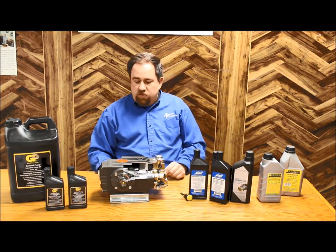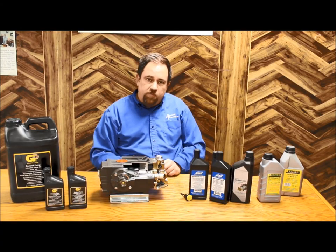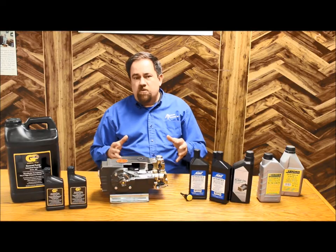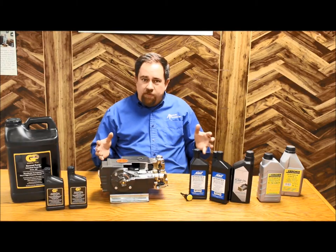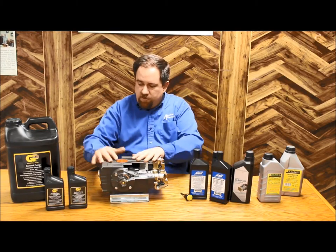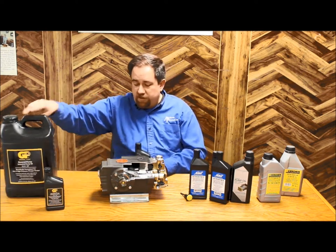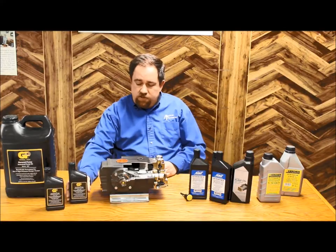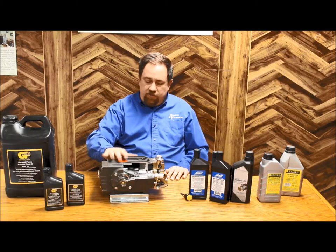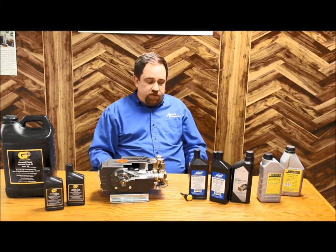Sometimes in cold climates with cold starts, we've gone to synthetic oils with a lighter weight. The point is, if you're not sure or you're not using it in a standard way, give us a call. We'll go over your application and see what oil we should recommend. Sometimes this pump would be great with this oil; in rare cases, you might need to use a little bit thicker oil. In other cases, you'd probably want a really thin oil — like a 5W weight synthetic on the low side for better start-up.